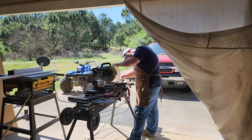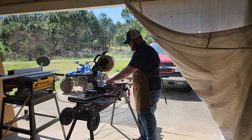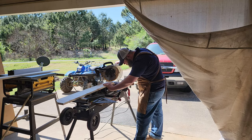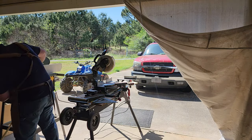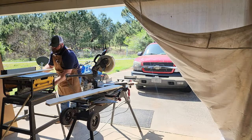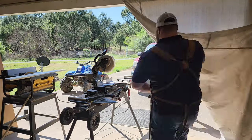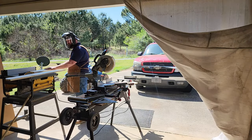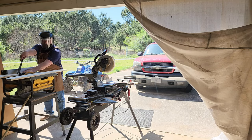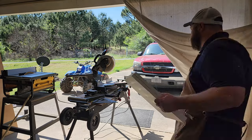What I did was measure three inches up and two inches over, and that gave me an angle of 32 and a half degrees. I locked that in on my miter saw and then just cut my pieces after measuring the two inches out, or three inches up, after that. I only had to measure and create my angle once, then repeat it. Here I'm making both pieces exactly the same size — even though I split the difference earlier, it didn't quite work out, so I'm cutting a little sliver off — less than the thickness of the saw blade — and now they're dead even.